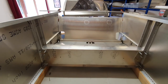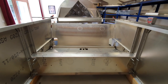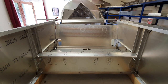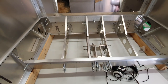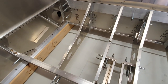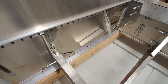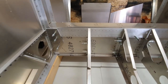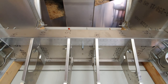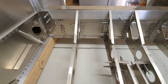It's all braced at the top at 40 inches just to keep it all together whilst it's not connected to the tail cone. Now I'm standing where the seat back was, looking forwards. And we've got the seat formers, which there are four of, two brackets at the ends to support the seat as well. And then we've got the spar tunnel rear assembly, and in front of that the spar tunnel forward angle as well.